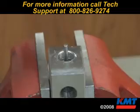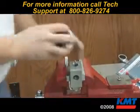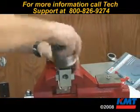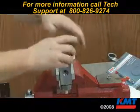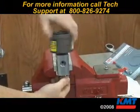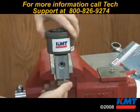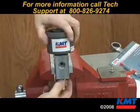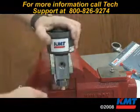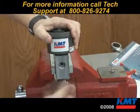Apply a little goop on the actuator and thread it in. As you're threading it in, when it just starts to feel a little tension, back the valve nut off that holds the position tool in there — back it off until it bottoms out. Then give it a good flip with the wrist to tighten it, and remove the valve nut and the position tool.